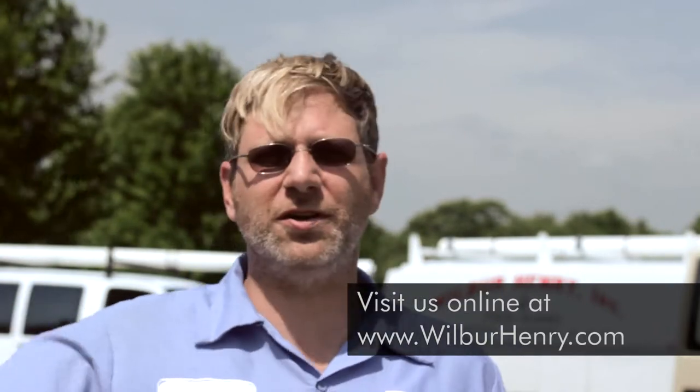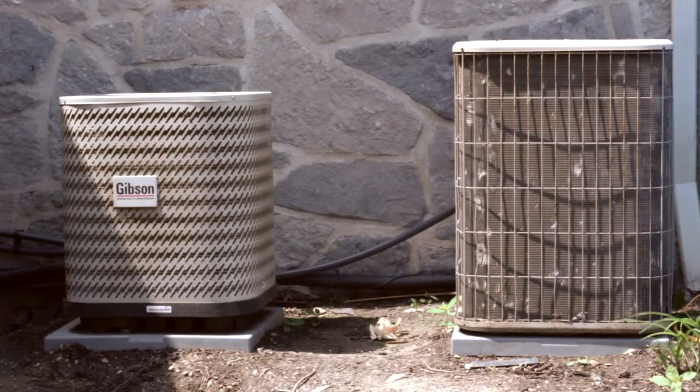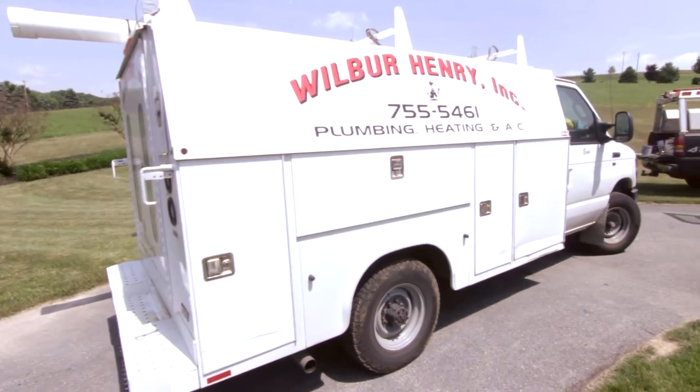Once you do that, just take your garden hose — simple water with a jet — and very gently clean the outside fins. On the indoor unit you have a filter to protect your A-coil inside against dirt, but outside there is no filter to protect the coil. So when your air conditioning comes on, any little dirt or whatever is beside it will get sucked into the coil when the air comes in, and it'll start not working as efficiently as it can.